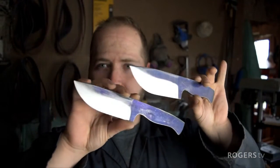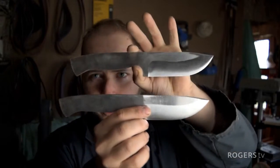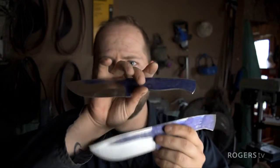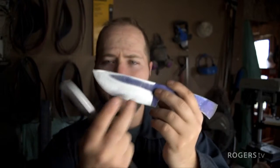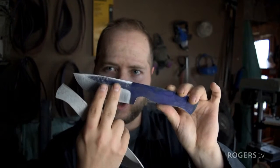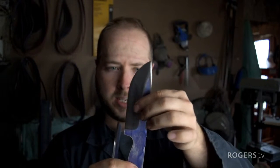After a lot of grinding, we have these two blades right here, and they're looking good. I worked them up to a 220 grit on the belt, and now I'll start hand sanding, and I'm only going to hand sand them. I'm going to start off with a 180 grit, and we're going to sand and remove some of those belt grinder striations, sand all the flats, work the flats into the bevels here. Just feels like a beautiful gradient into that convex.